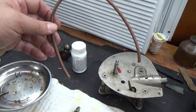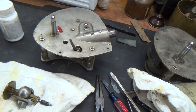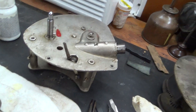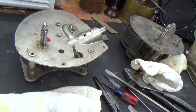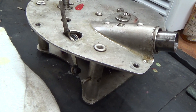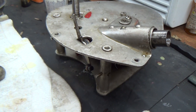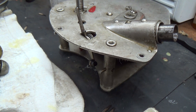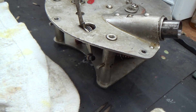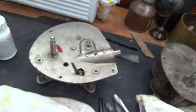They're cheap and they fit your brake and friction leather perfectly. Just clip off whatever size piece you need — about what you see there. There's nothing mysterious about that material; it's just a round leather belt. That's what everybody in the industry uses. Pretty much every phonograph has a friction leather somewhere. There is a smaller friction leather used on some Victor models — the ones with the speed gauge — and you can just carve one of the larger ones down to fit.